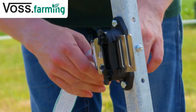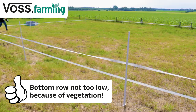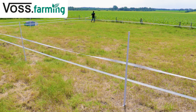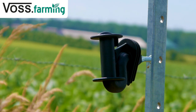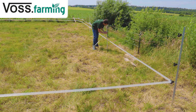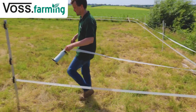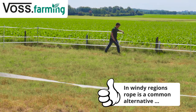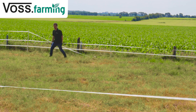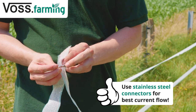And now to the conductor material. Make 3 rows — this is recommended by the Horse Association and is part of your insurance contract. The uppermost row is approximately three quarters of withers height, usually 1.2 to 1.4 meters, and the lowest is 40 to 50 centimeters so that escape artists have a hard time escaping. Your horses can see tape the best. We recommend using at least 20 millimeter electric fence tape, better still 40 millimeters. Do not tie knots — if you do, the conducting wires will break, the electricity flow will be interrupted, and the fence will become unsecure. Use connectors; we have rope and tape connectors. Also use the connectors for the beginning and end of the fence.